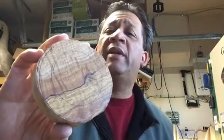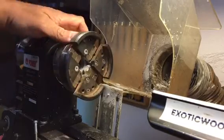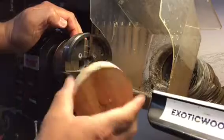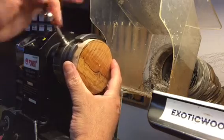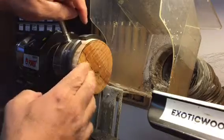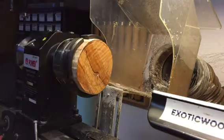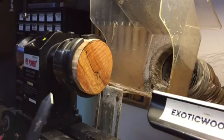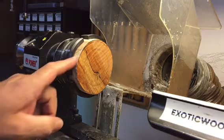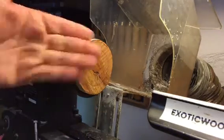We'll go ahead and get started. In my lathe I've got my four-jaw Barracuda chuck mounted — I just changed the jaws out so it's gonna fit in here and we'll clamp that down. I've got about half that thickness to work with; this blank is about three quarters of an inch thick. I'm going to cut the center out first using a parting tool to knock out that center so I can save it, then I'll do the outside, make it round, cut halfway through, flip the blank around, and continue.